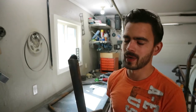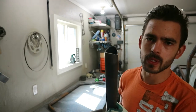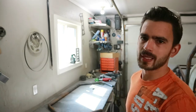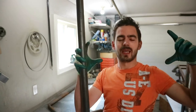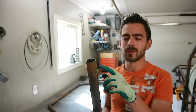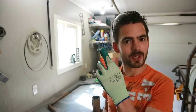I haven't invested in a tubing notcher yet, so this is taking a little longer than I wanted, but the die grinder with a carbide burr is actually working pretty well to do the fish mouth. I got one end done. The other end is going to be harder because I have to get not only the right contour, but the right length and it has to sit level. I'll trace it out, cut it, and cross our fingers.